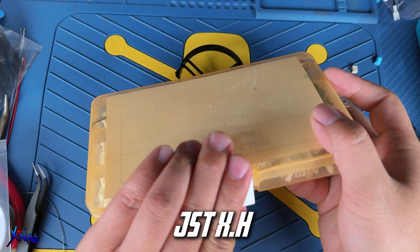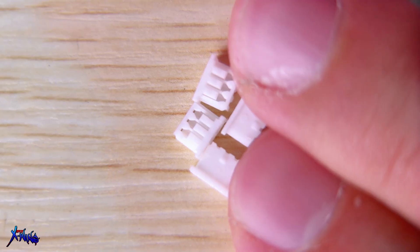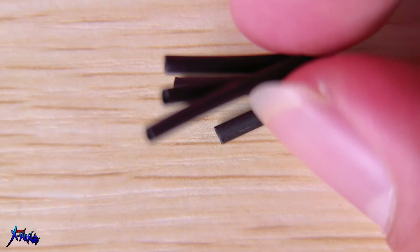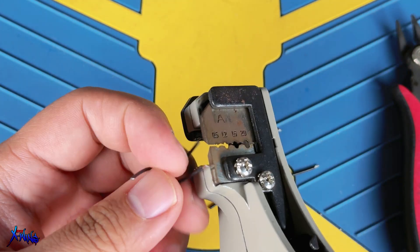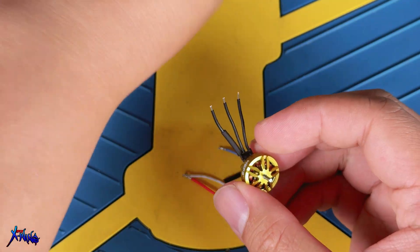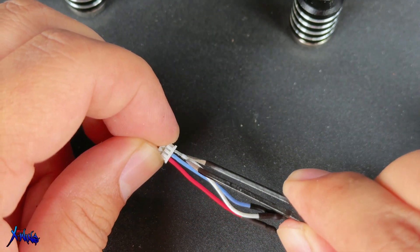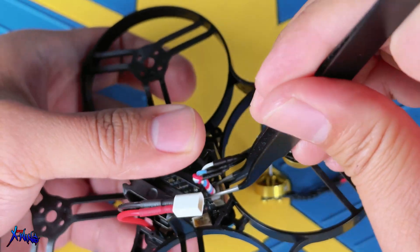To make connectors, you will need a box of assorted XH connectors — you can buy these on Amazon. You're going to need four 3-pin plugs and six wires with pins on both ends. Color doesn't matter since you'll get assorted colors anyway. You'll also need some heat shrink tubes. First, trim the motor wire to a shorter length and strip the end slightly longer than usual. Cut the connector wires to match and strip them to the same length. Slide the heat shrink tube onto the motor wires, solder the motor wires and connector wires together, then move the tubing over the joint and shrink it with a heat gun. Finally, plug the wires into the connectors in the correct sequence. Repeat this process for all four motors. Once done, screw the motors onto the frame and plug them into the AIO.